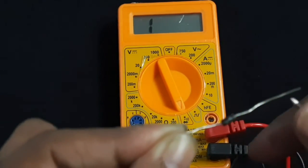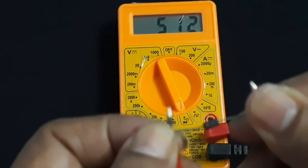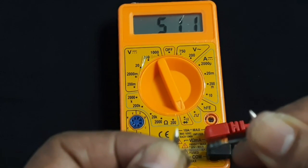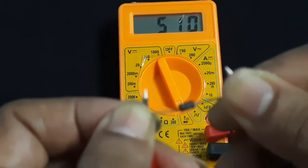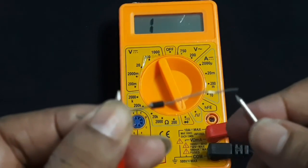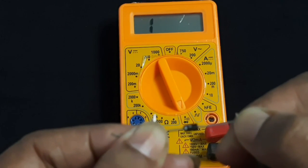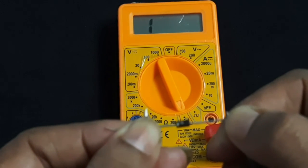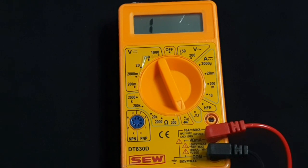The silver ring is the negative terminal. Applying negative to the black knob and positive to the other — when forward biased, the resistance will be in the order of hundreds of ohms. When reverse biased, giving positive potential to the negative terminal and negative to the positive terminal, the resistance will be out of range and show overflow as '1' in the first digit. In this manner you can check the working condition of the diode.